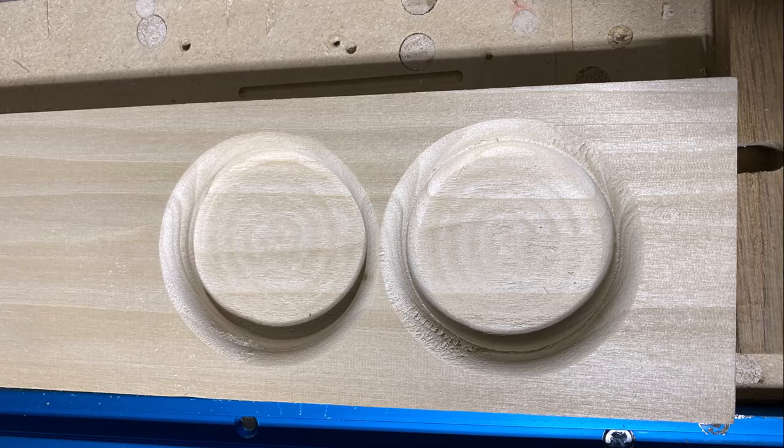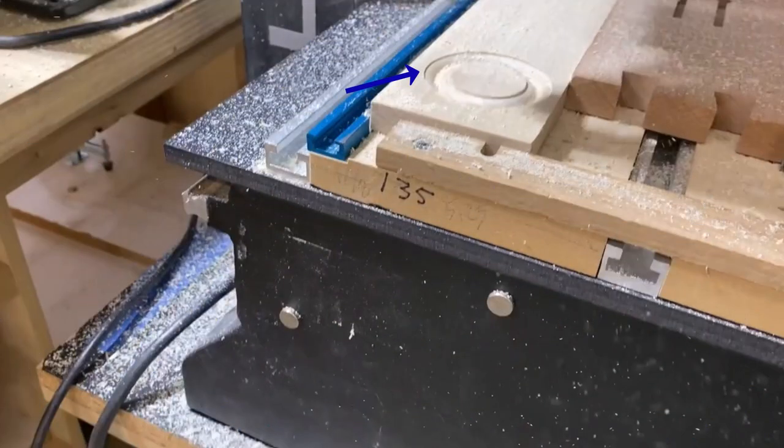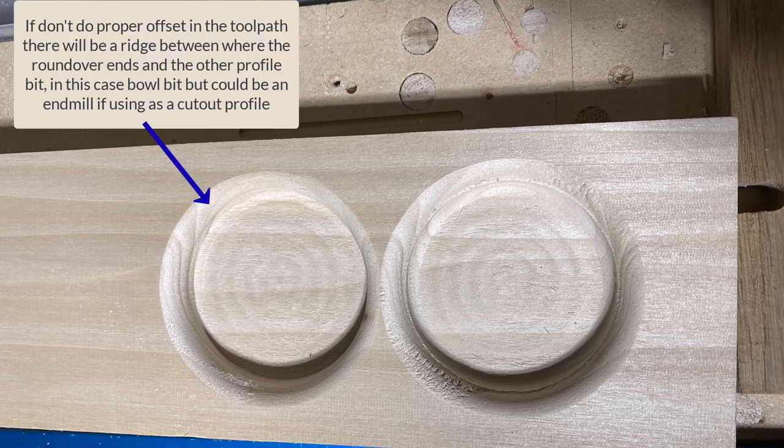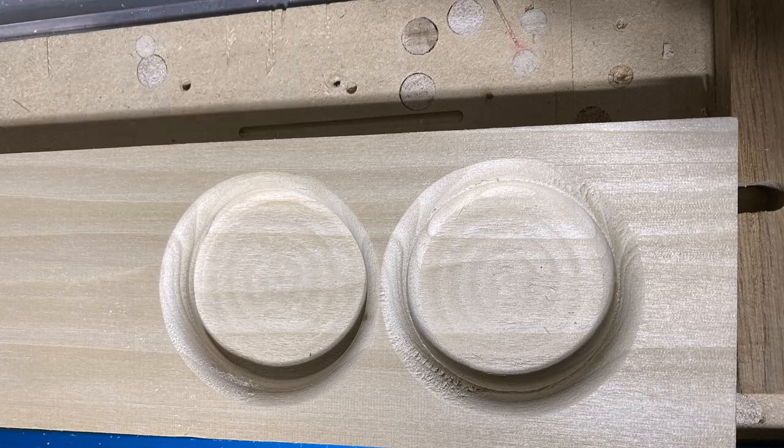We discussed the importance of two things: how deep you set the cut depth, and proper offset for the plunge roundover. The plunge roundover depth was 0.375 for a flush roundover; the point roundover was 0.2 even though stated as 0.25 — using 0.25 leaves a visible ridge just like you see here. Overall both bits do a good job, but with the plunge roundover you must use an inside or outside offset equal to the diameter of the plunge section. I hope you learned something and can take this to your next project. Have a great day — please give me a thumbs up, share, comment, and subscribe.